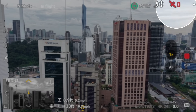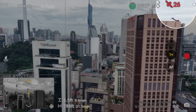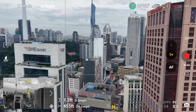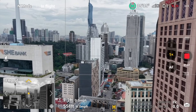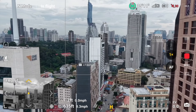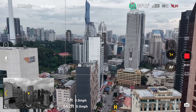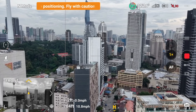The first thing to notice here is that I actually don't have a GPS connection — you can see the satellite locks slowly going up, jumping around between 24, 26, 28, but it's not white, so no GPS lock. That would usually be something to worry about, but that is actually one of the features of the new next-gen smart RTH: you can start flying without a GPS lock. I still really wouldn't advise it, but if it does happen, the drone hopefully will be able to return to home. We'll see — I'm testing it out, and I'm still having to fight the urge to stop.